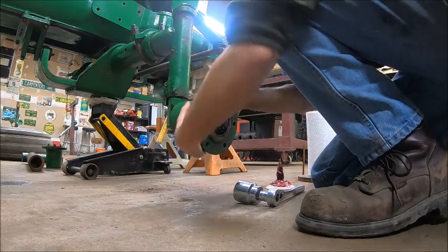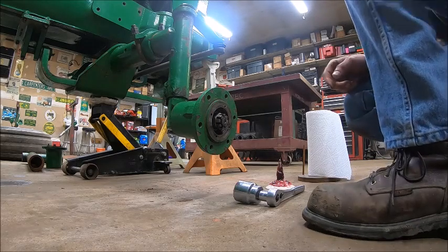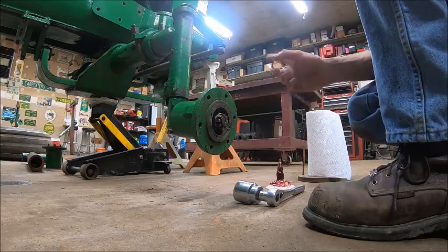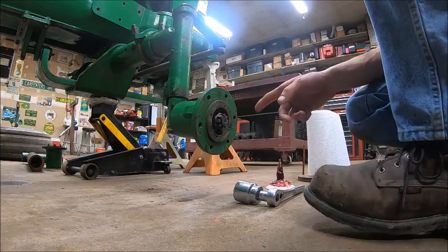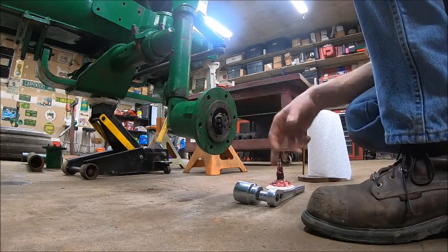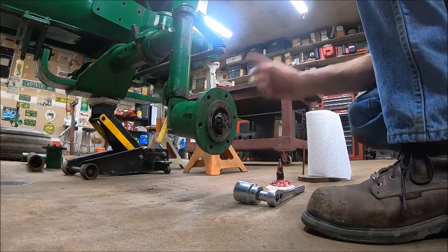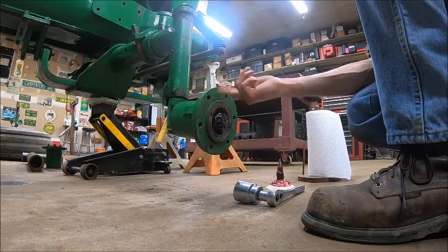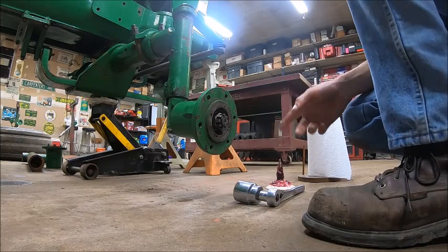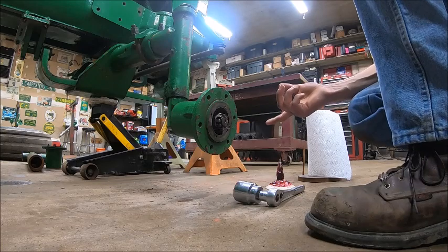I think we're gonna go with it because I like that. And then you just stick your cotter pin in it, and I'm gonna put the hubcap back on it. But when I do that, I'm only gonna Permatex the side of the gasket that's on the cap itself with the ridges, because of those strengthening ridges that are stamped into it. And I'm gonna leave the side that mates up against the hub dry. That way, A, I can run this thing over a few acres, pull it back apart, check the wheel bearings, and not screw the gasket up.